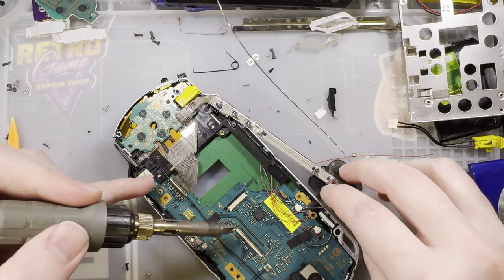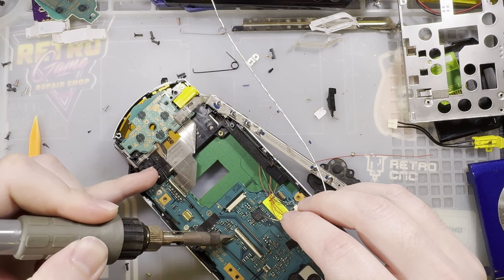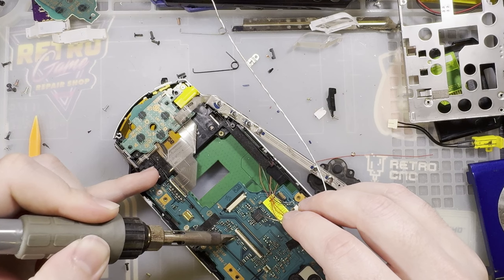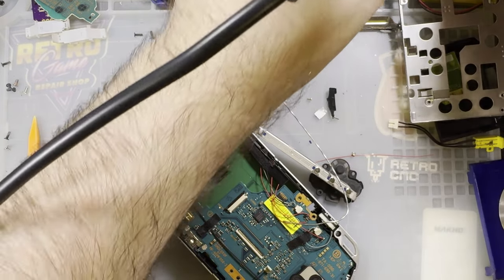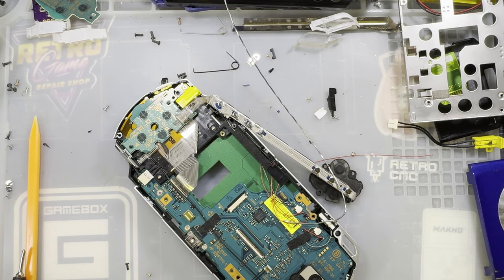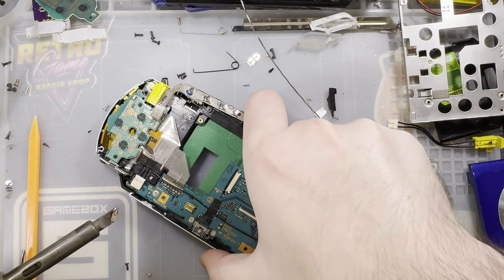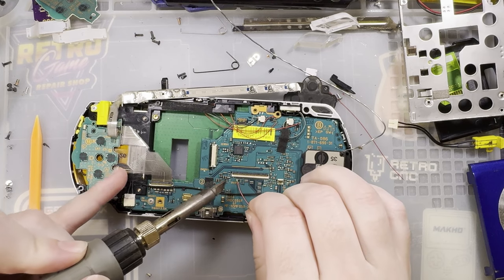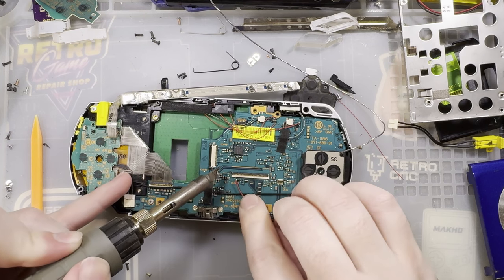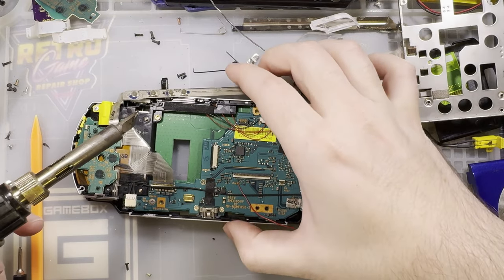I think it's probably easiest to just solder a fuse in there, to be honest. You know what? I'm in a particular kind of mood. Let's do exactly that. As I knock my light over. Actually, nah. I don't want to have to go find a fuse. That one I can just take a wire, run that across both pads, and solder it down. And then that's it.